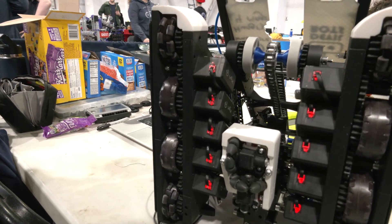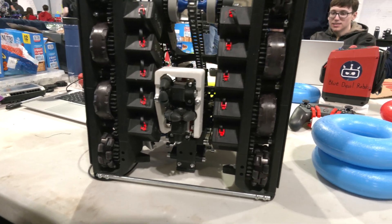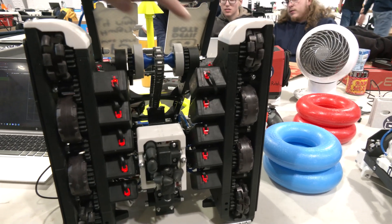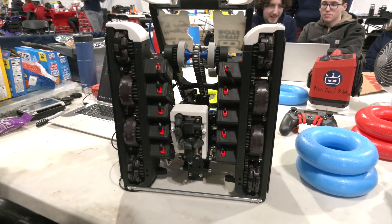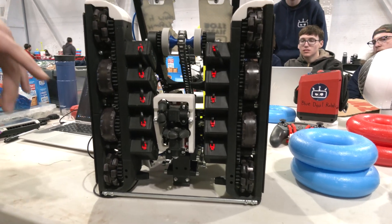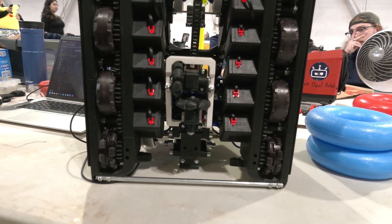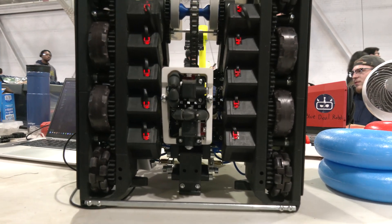That's why you can see these segments here. Because of our ability to 3D print, we can optimize our time building and reiterating as fast as we can, and we don't have to replace the main components. The motors are mounted flush in the 3D prints, which allows us to utilize more space, seen with our odometry. These use a custom linear slide to allow us to track our movements on the field a lot better than the motor encoders themselves.